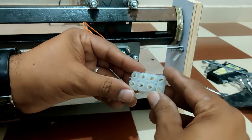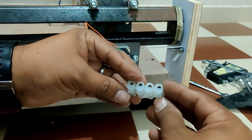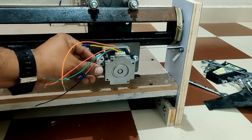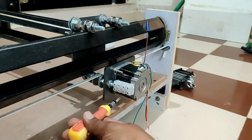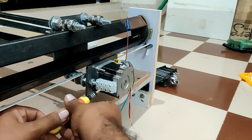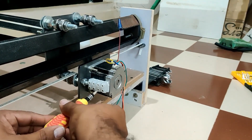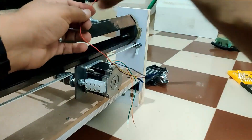As you can see, they're made of plastic and for about a dollar I got all the connectors I need — about 36 pieces. I've grouped four of them together, cut four together, so they can be used for each motor. I'm using double-sided tape to fasten the four-connector piece to a motor, and I'll just remove the screws up front so that it is easy to connect the stepper motor connections.